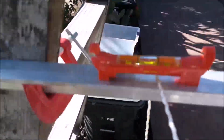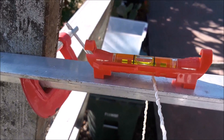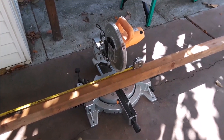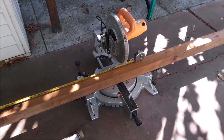We'll go back up to the top and try to get you another shot up here. Sun is in the way, but clearly that's how we want to be. So remember, the string is level and so is the cross beam on the 10-foot ladder. Here I'm going to go ahead and chop up this 4x4. I have it measured exactly where I want it — 85 inches and a quarter.